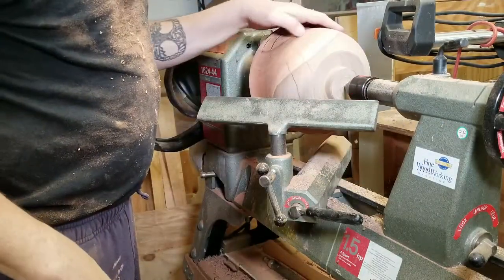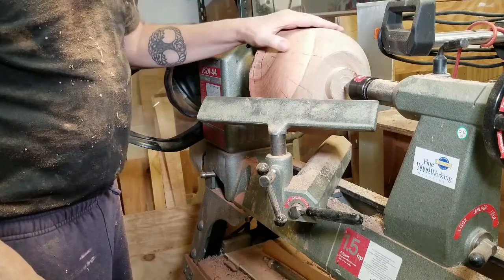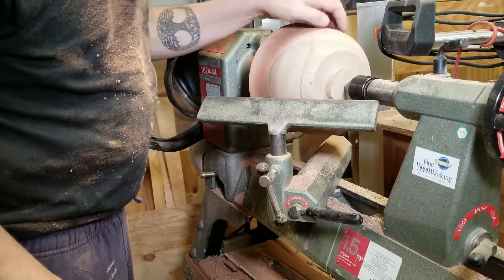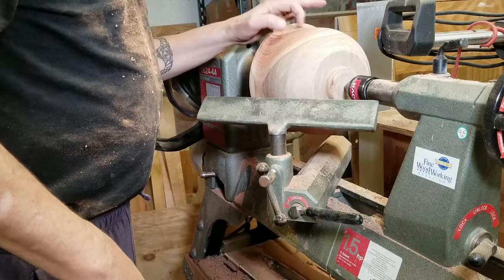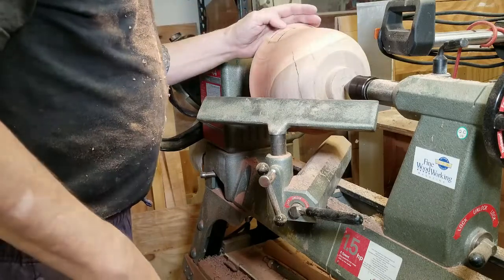Well, we're finally getting somewhere. Prefer the bowl gouge. It makes a much smoother cut, and this has a lot of tear out in it. At least we're making cuts now. Some of the cracks on the inside, a couple of them are pretty good size now. So I think I'll do a super glue fill and then sand it in the morning.